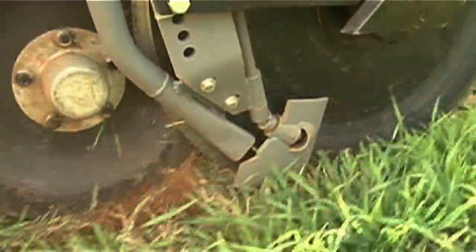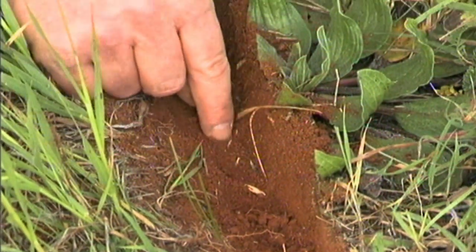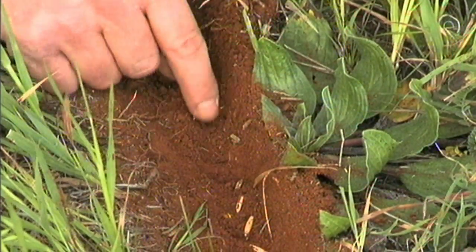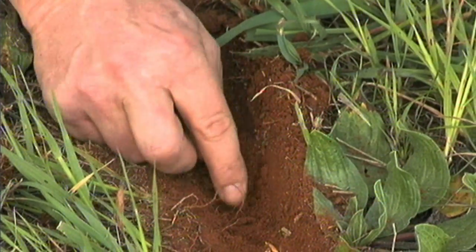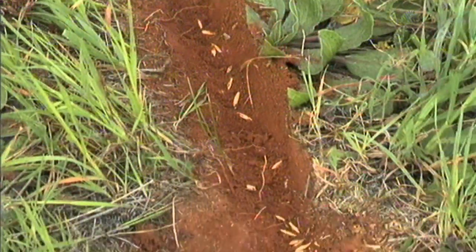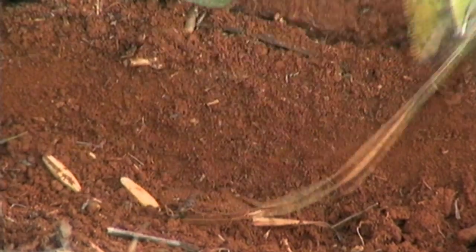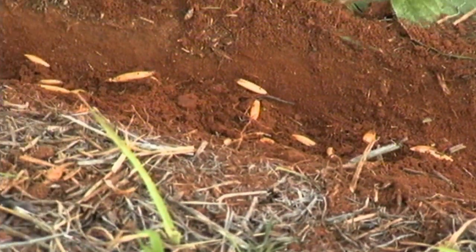Don't forget this was planted at speed at 15 to 20Ks, and you still get very good seed placement. It's very important when you're setting up — forget about speed at the beginning. Plant at 10Ks conventional, make sure you're getting good seed placement. As soon as you learn how to operate the machine and you're happy with your inch and a half depth or whatever you're planting at, then you can experiment with speed. I would expect nobody in their first year will be planting at over 20Ks — 15Ks would be doing very well. In your second year, you should basically be planting at about the same speed that you're spraying at, provided there are not too many rocks. So 40mm is a fairly typical depth — don't be afraid to take the tape out and check it. Very important, constant depth. Plenty of seeds down at that depth — looks like a nice clean job. Friable soils, and we should have a very good germination.